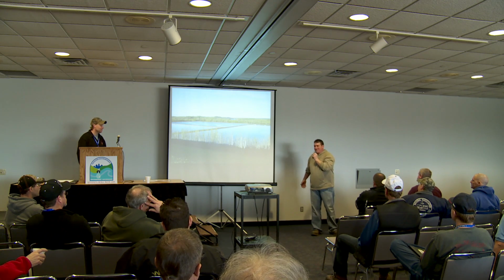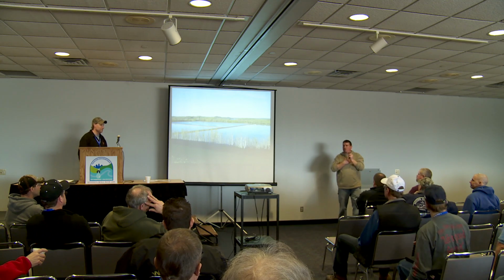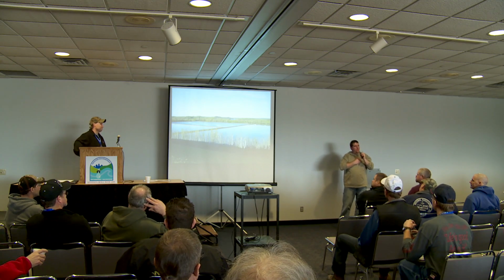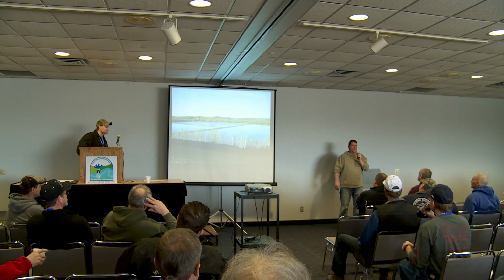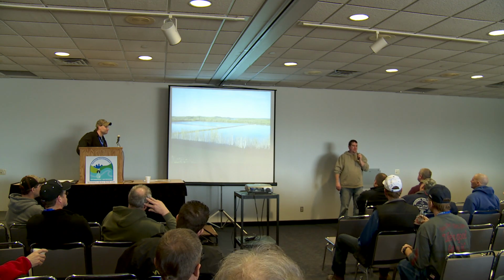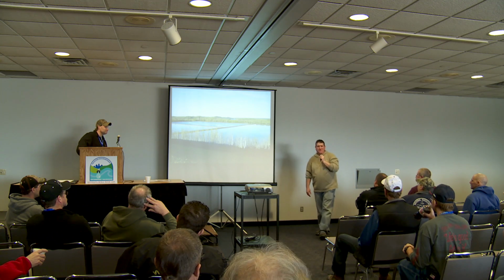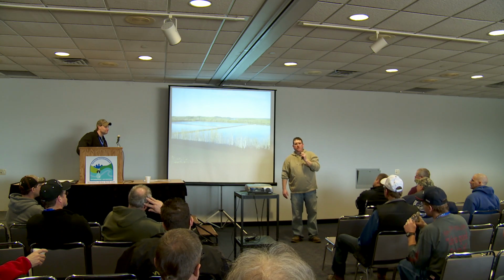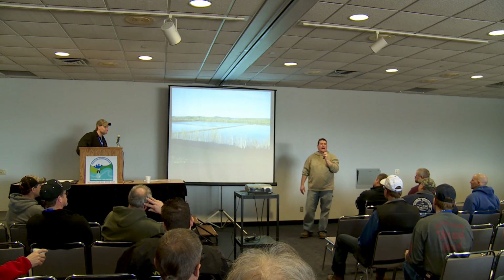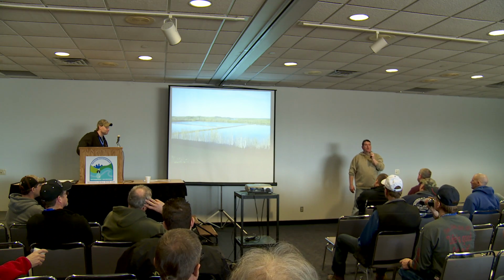I'm not a huge advocate of septic haulers dumping in the ponds, at least when I used to work in a community that had ponds. It's very difficult, Don, because if you tell that septic hauler to test for phosphorus, well, now we've got to wait 3 days and we've got a full load in the back of my truck. Probably not going to happen. But I would bet you that the total phos would be quite high out of a septic tank. 20, 30, 40, a couple hundred parts per million.